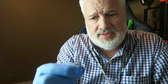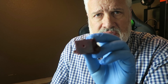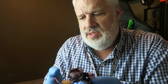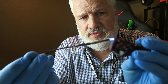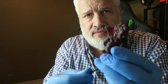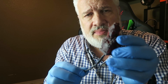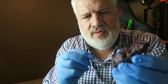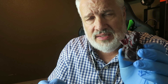Here's one of my prints, and as you can see it is hollowed on the bottom. So what you have to do is take your UV light, turn it on, insert it thusly, and snake it up into your print. Hold it in various areas for as long as you deem necessary to cure the inside. Once you complete it, you should have a cured inside of a hollowed out print.